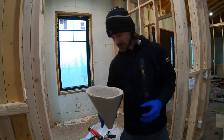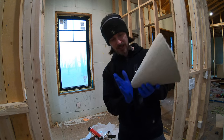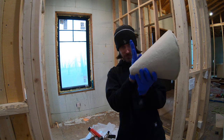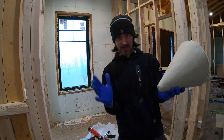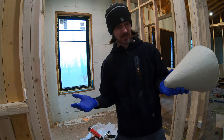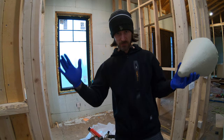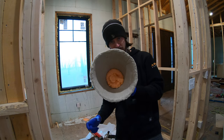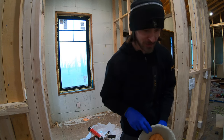All right, so that's enough of those. And this actually should help out with the R value now too, because again, we're losing 9 inches of insulation, pretty much, from inside of here down to where this isn't gonna be insulated. So over every single light, we're not gonna have the R60 that we plan on. So we're losing at least 8 or 9 inches or so out of the total that we need to pour in there. So at least with that much insulation or spray foam now up in there, these are a little bit more insulated and should help with the overall R value of the house.